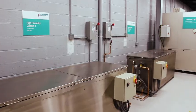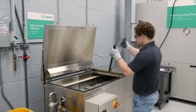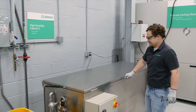These are the thermal cycling chamber and forensics area. When we make insulating glass units we're looking for long-term performance, so we test them to ASTM standards. That involves high humidity cycle testing where we put them in the racks in our high humidity cabinets and subject them to hot humid air circulation over a 14-day period.